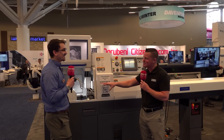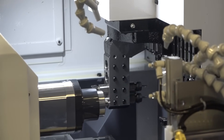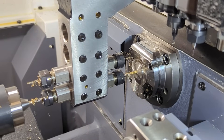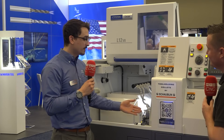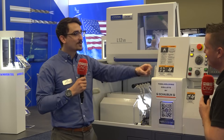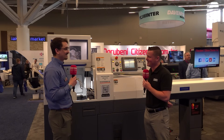Something else we wanted to talk about today is a really unique vacuum system in here. This vacuum system is amazing — it's a newer design that does three main things: it separates your part from chips, prevents any falling through holes during normal eject, and helps protect parts so they won't hit each other. If you're dealing with needles, it's not going to bend the tip. You eject normally, the subspindle comes over, the door opens, it vacuums out the part, and in this cone it works like a cyclone — you come down gently without any thumps or hits, and it brings the part down into your little bucket.